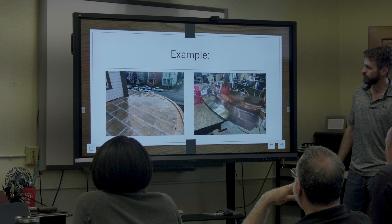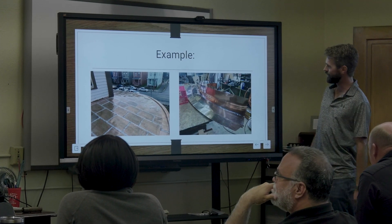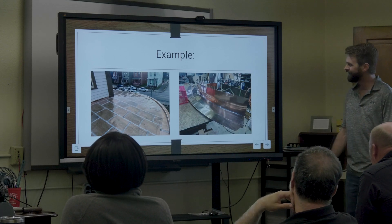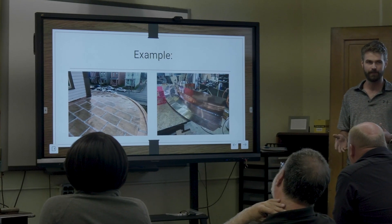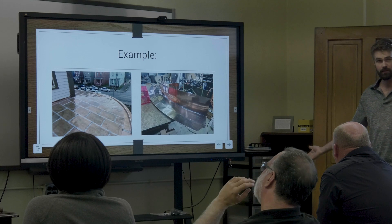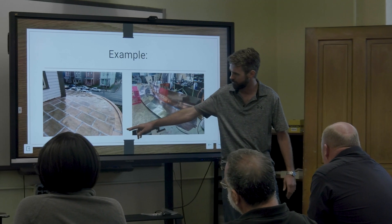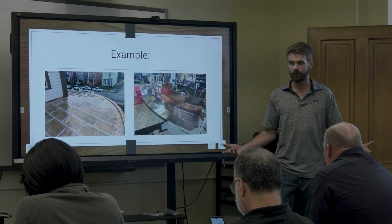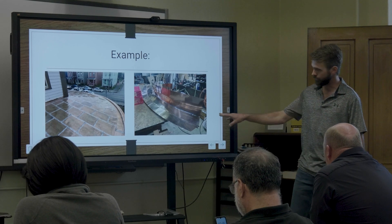Here's a fun little project we did over in Bellevue — a flat-locked copper 16-ounce roof with a radius gutter. That's a rare thing — you're not going to see it on an average house. A lot of times somebody will make little one-foot sections and try to wrap it — it's a primitive thing and it works for a while, but then you have 20-25 places where you leak. Box gutters are going to be done in 10-foot sections most likely — that's the size of the brake, the tool that bends the metal. You want to do as few seams as you can.